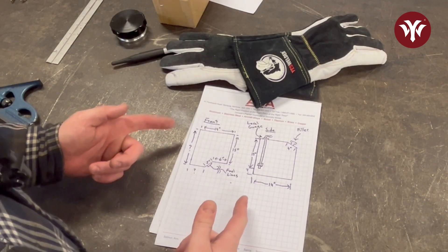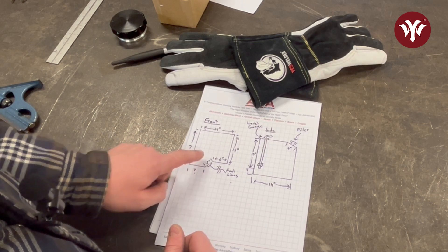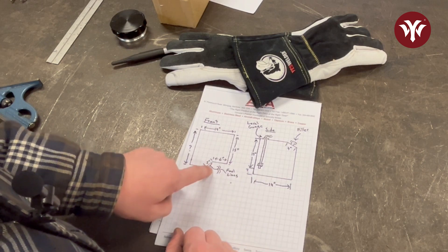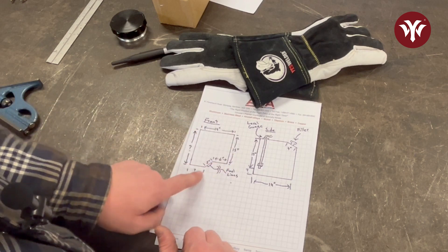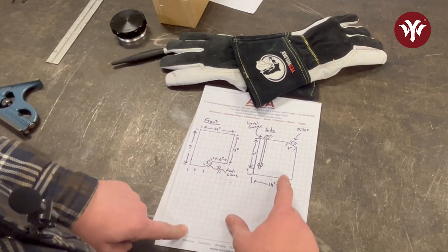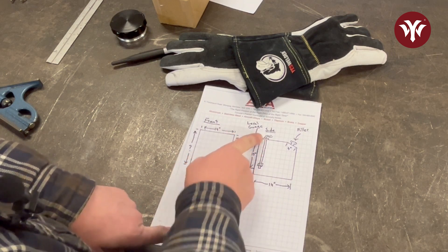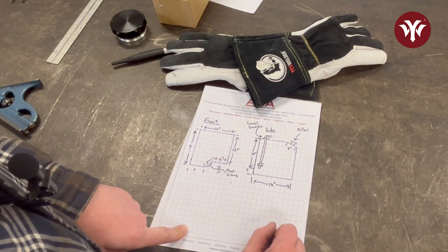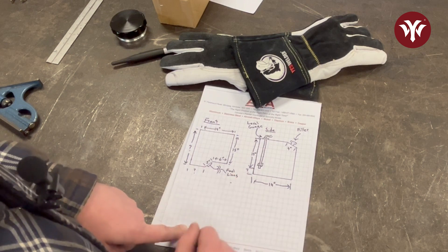Here's the fuel tank we're looking to build today. This is the view from the back of the vehicle looking forward. It's going to have a slight jog in the bottom of the fuel tank to account for some components that are already there. The fuel lines are going to pull off this chamfer in the bottom and go inside the engine bay. I have some approximate dimensions — the others will reveal themselves once I start laying it out. This is a side view of the tank. We have a sending unit dropping down to give us our level gauge, plus a vent. I'm going to have a chamfer on the back of the tank where the filler neck goes in, just to help pour jerry cans of fuel in a little easier.